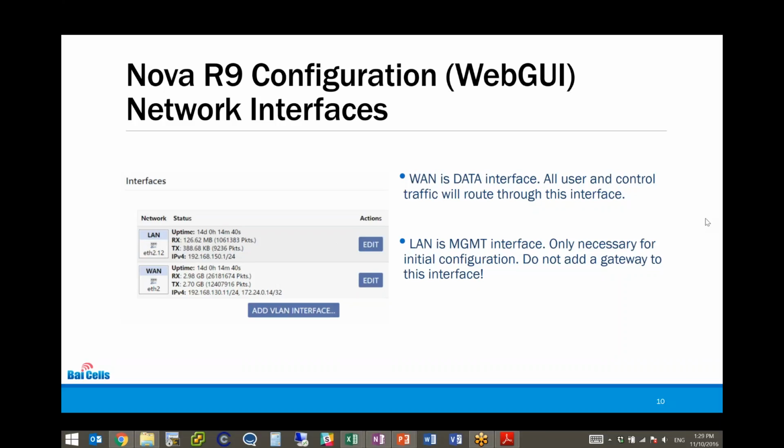Did you say that there's no planned upgrade path to Release 10? I don't think you said that. Well, there is of course, but this is not a software-defined radio. While that's a great thing, those things come at very high cost. So the development choice was made that we are a chip-based eNodeB. So we can't natively just upgrade to features like carrier aggregation in this particular piece of hardware, I do not think. Jesse, you can correct me on that. Yes. Eventually things like Release 12, which has another host of major new features of LTE, will come in a later version hardware product.